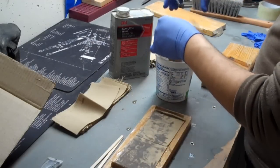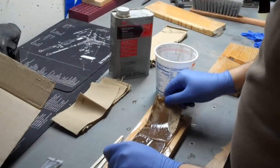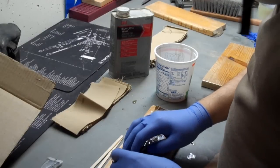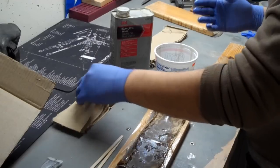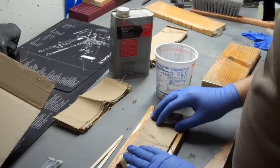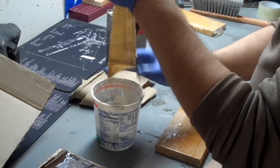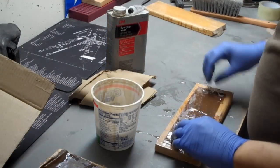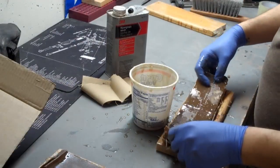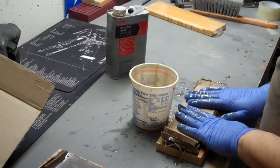The resin is very thick — about as thick as maple syrup — so it can actually be quite messy to work with. It likes to drip and stick, and trying to get it to soak into the fabric means you are going to be getting it everywhere. Putting a drop cloth down or a piece of cardboard to work on is probably a wise idea. I'll also show how I get pieces of fiberglass off my work table.